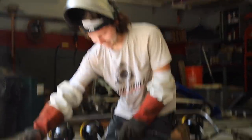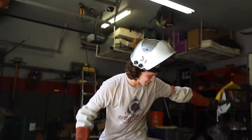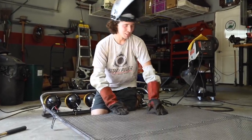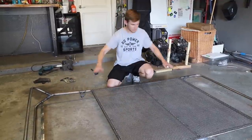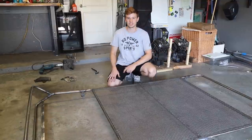We are done — that was a lot of welding. I feel like I was at a football game wearing a mascot helmet for four hours. This looks awesome. What we need to do next is our sidebar. We're going to keep it simple and match this 35-degree bend up here, just having a straight bar coming down at that same angle in the back. Let's get to bending.